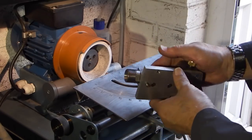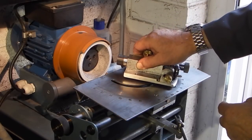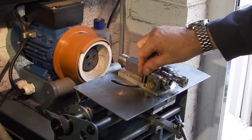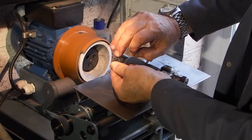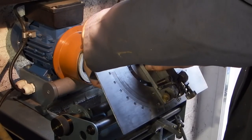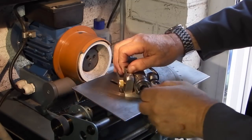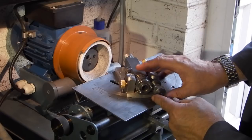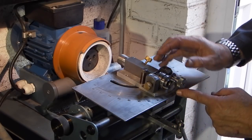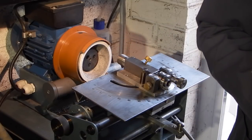This is the indexing fixture I've made with the pin. The pin locates in the hole, the screw goes through here, and this little nut has a little pin in it that stops it turning — that goes in the slot on this radius — and this will lock the fixture. I've got my position mark in there so I move that round to zero and lock it up so it's square to the wheel.